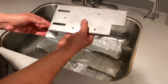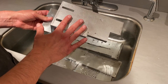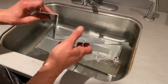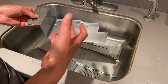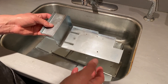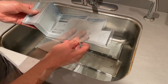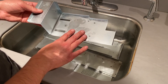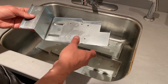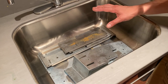Now that we've removed the corrosion from these chassis parts, I want to make sure they're still protected with the galvanization — making sure I didn't remove that layer and go through to the raw steel. So I'm doing a test: I'm going to let these soak in water, take them out periodically, expose them to the air, and put them back in. It's a torture test to see if they start to rust. If there is exposed steel, these will start to rust pretty quickly. I suspect the zinc plating is still mostly fine, but there may be a couple of spots where I've worn through. Wherever we see rust, we'll touch up with some zinc cold galvanization spray. It certainly didn't take long to start seeing rust on some of these chassis components.